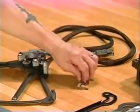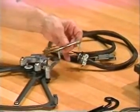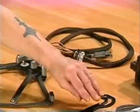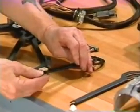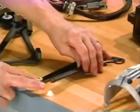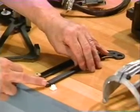Part of our inspection would also include the carburetor type linkage that is used to close and open the respot cells. Here we can make a comparison between the older fingers that had the large insert, made it a little close to the next cell, as compared to the new style finger with just the flat insert, giving us much more clearance.